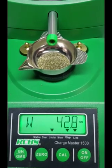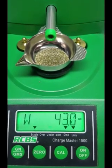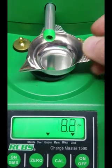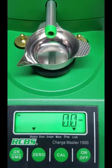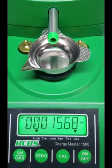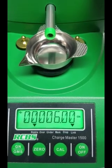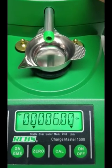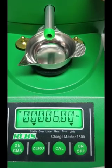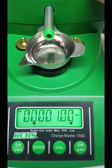I'm going to share how to do the settings. There's an Edit Memory button and an Enter button - you press those at the same time when it's at zero. It says 'Adjust Parameters.' Speed 1 is 15.68 - that's the stock setting. Speed 2, or B1, is 6 - that's how many grains away from the end amount it goes from high speed to low speed. So for throwing 43 grains, that would be at 37. The next one, HSP C1, is 1 grain away - so when it hits 42 grains it slows down.